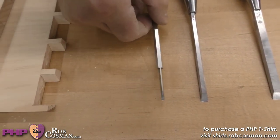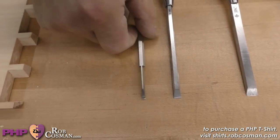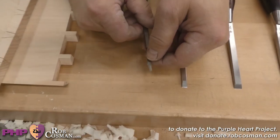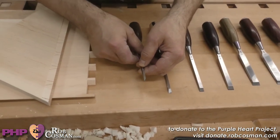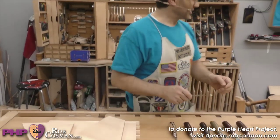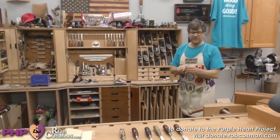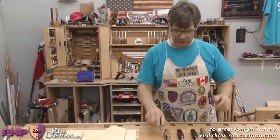So we're going to start selling quarter-inch chisels that are ground down so that you've got an inch and a half, an eighth inch. You've got your little flat landing. You've got your clearance on the sidewall, extremely precise. And he said when he grinds them, because we use the new CBN wheel, the coarse wheel that we got, they don't even get hot enough. You can still hold them, so you don't have to worry about the temper.